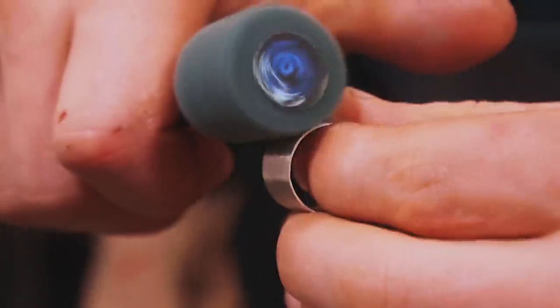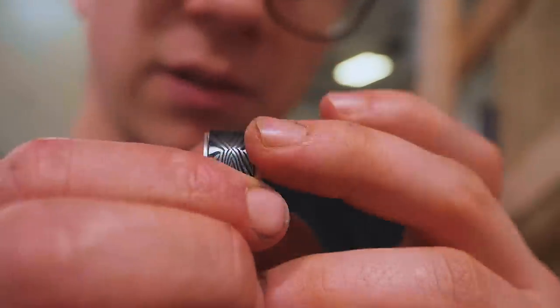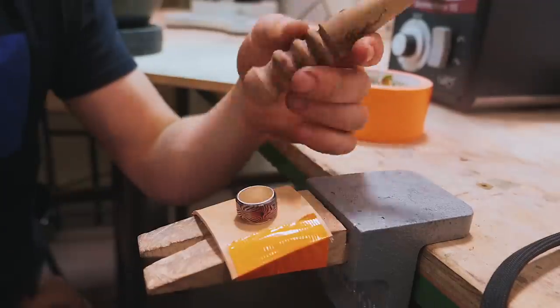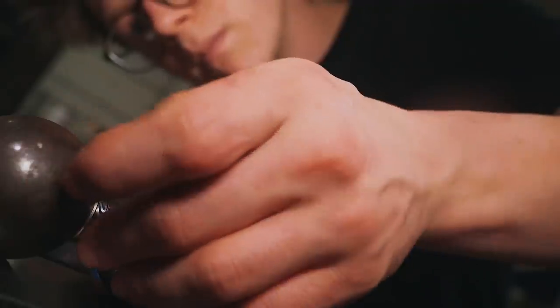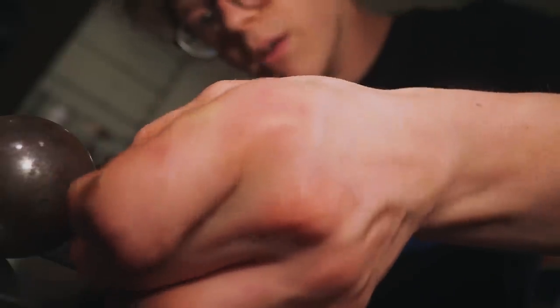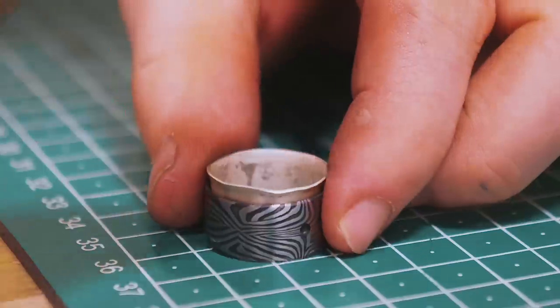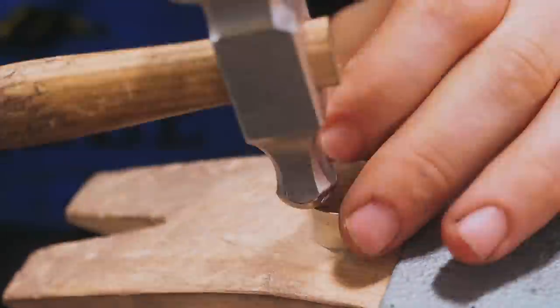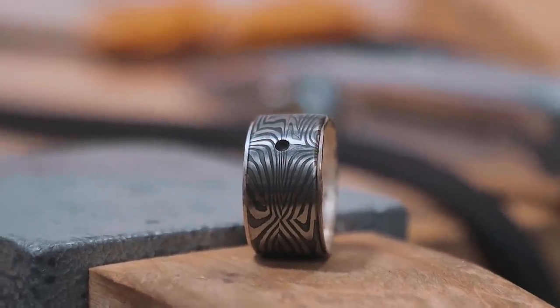I'm going to polish this up and see if they still fit, then center the ring in the silver. Somehow I have to get that silver to roll around the steel and hold it captive — I have no idea how I'm going to do that. After some trial and error — this has been a nightmare — I'm getting the idea of how to do this. I filed a little taper on the inside edge of the silver, which seemed to help prompt that silver to start rolling over the steel.